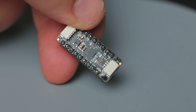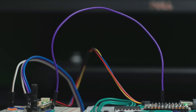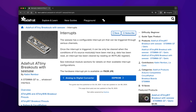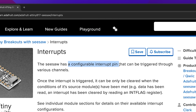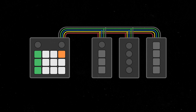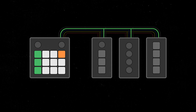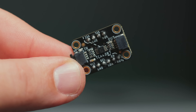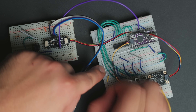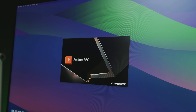To test out the module idea I connected the Seesaw breakout board and attached an encoder, potentiometer, and a button to cover the basic cases. An extra wire represents the interrupt on the connector. I'm trying to avoid spamming the I2C bus constantly and instead leverage the Seesaw configurable interrupt for digital inputs — it triggers when there's an interaction on the module side and clears the flag after we read it from the macropad side. One thing to note: I allocated only one interrupt pin for all the modules, so we can't pinpoint the exact source of the trigger — any change should prompt a scan of all modules. I also added an I2C hot swap controller to avoid issues if we disconnect mid-communication. With these requirements laid out and a basic prototype in hand, let's jump into Fusion 360 and get started on the PCBs.